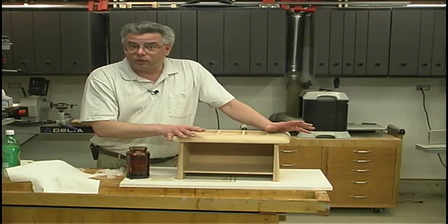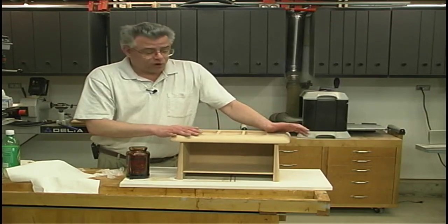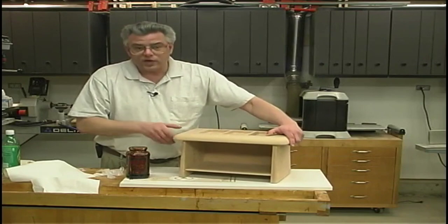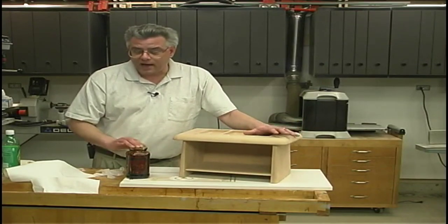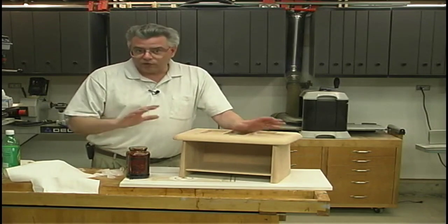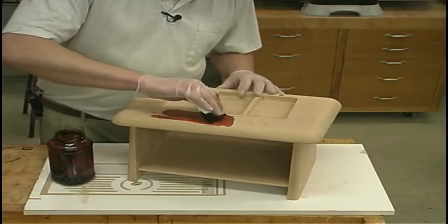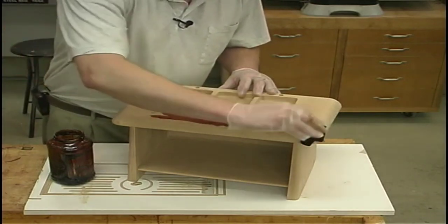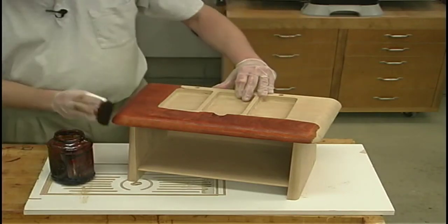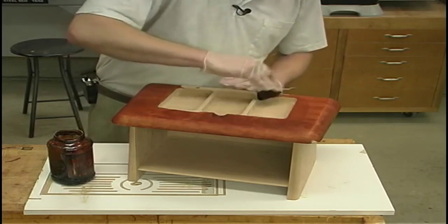With the assembly pretty much done, we can turn our attention to some finishing. Now originally I just planned on applying a wipe-on oil and urethane top coat product. However, there's enough sapwood on here where it's very distracting, so what I want to do is color all of the wood. To do the coloring process, I'm going to be applying an aniline dye — this is an alcohol-based product and you pick it up in a dry powder form. This particular color is called Antique Cherry Brown and I've used it on a couple of other projects. I'll just wipe on a good wet coat, let it dry, and then we can move on.